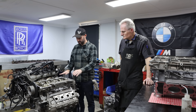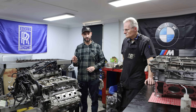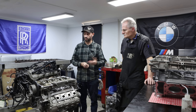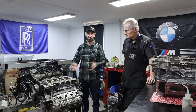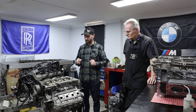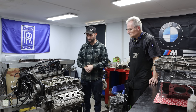Generally speaking, these aren't a flawed engine — BMW didn't get it wrong. It's a tight-clearance, very high-revving engine — 8200-plus RPM standard — with very narrow conrods. They just require heavier maintenance that other engines like Toyota engines or LS's don't. You need to be prepared to get in and do these bearings as a service item and the engine will live on forever. Race engines are rebuilt race-to-race or every second race for exactly that reason — tight clearance engines do their work and then need components changed. This engine sits in between a road car and a race engine, probably closer to race, so keep that in mind.